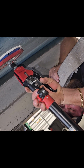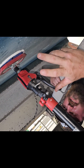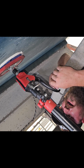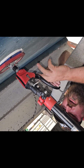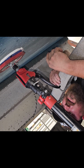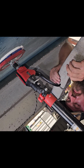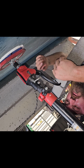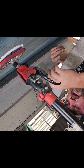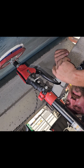And then we're going to take our little mini shoring pole here, and we're going to stick that on here. Sometimes what I'll actually do is I'll just push that on. Don't push it up too hard. If you push too hard, you can actually push out too much sealant, and then there's not actually any there, and that can cause a leaking issue. But sometimes what I'll actually do is I'll put it like this and leave it overnight. Let it cure, and then come back the next day and do the inside of the boat. Especially if it's a boat that's very tight quarters, and I can't get the wrench to hold the transducer and the wrench to hold the nut both in there at the same time, I'll let it cure overnight, let it get hard, and then come and do the inside the second day, and that seems to work a lot better.